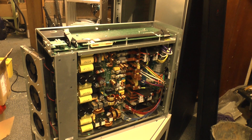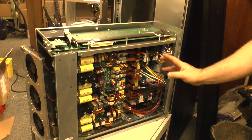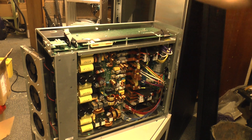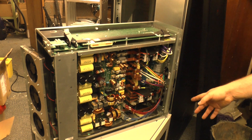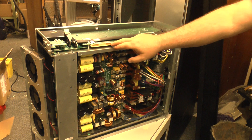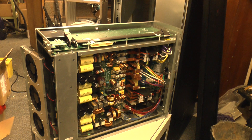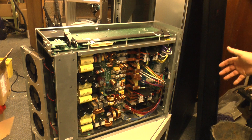And this is what's inside. This is similar to one half of the 40kVA unit, where we've got the power interface board here and various other heavy duty gubbins at the back. Behind that you'll have three 6.67kVA power modules — on the 40kVA one it had six: three in here and then it had to load in a second unit which was bolted alongside. At the bottom we can see a toroidal transformer, which will be for driving some of this stuff when it's actually running on the mains. I think this is where it connects through to the second module if one is fitted, because that would sit over on this section on this side of the chassis, and then the whole lot is wrapped in one big metal can.